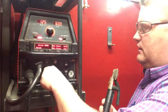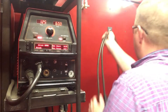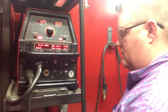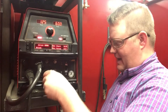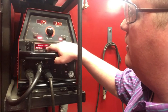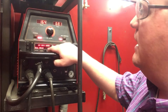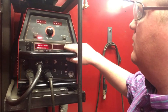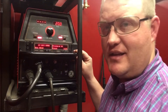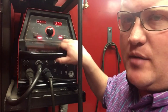If you want to switch it back to MIG GMAW, coil that one back up, hang it back on the wall, get your GMAW lead, plug it back in, and run it back around — it should go. There's TIG, gouge, switch, CV MIG GMAW with standard CV on this side — that's what we want for running our GMAW process. There are lots of other processes that run on this machine, but those are the two we'll see here in our shop at Weber High. Set it up that way and it should be pretty simple.